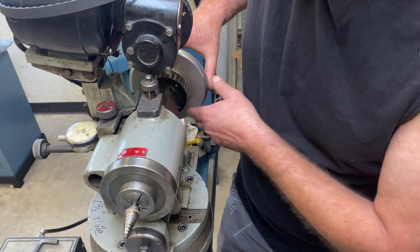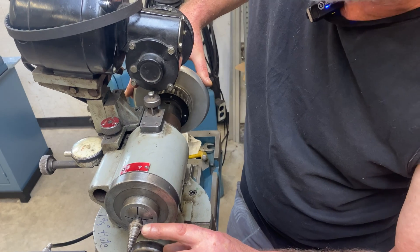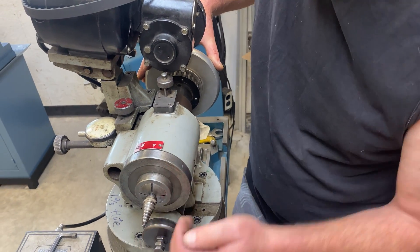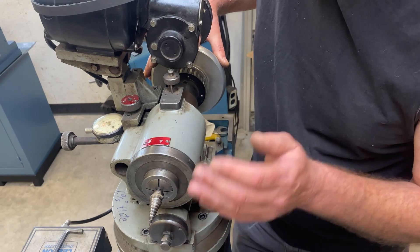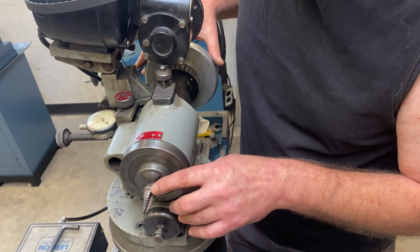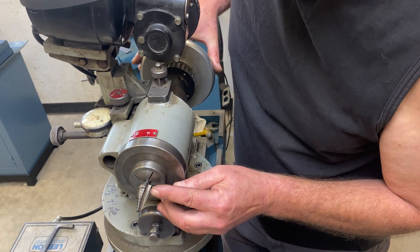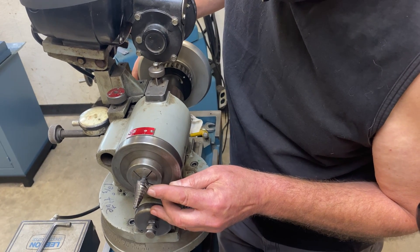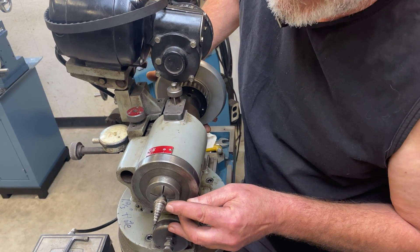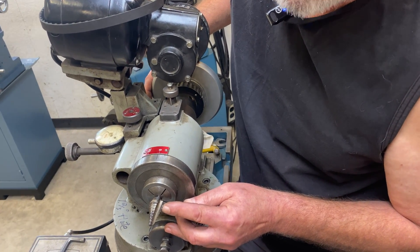Eventually it's going to start coming back and resetting as we near our line. Before it gets to zero — where it started cutting — the trailing edge of the tool has risen above the center line. I'll be able to lock out these cams so it's just spinning around and we'll prove this: we'll put a dial here and what we're going to see is it's going to go minus all the way, then stay there, then start coming back — but the highest the dial gets at the back edge will still be lower than it was at the leading edge. That's how we'll know there is in fact relief on there.